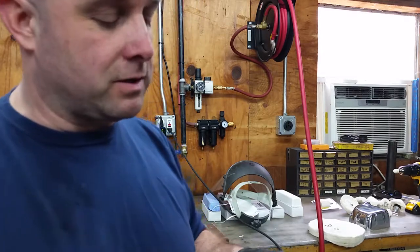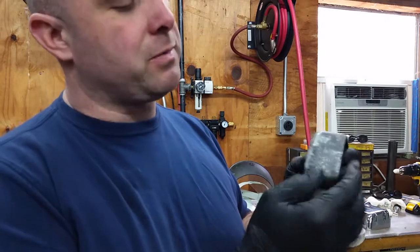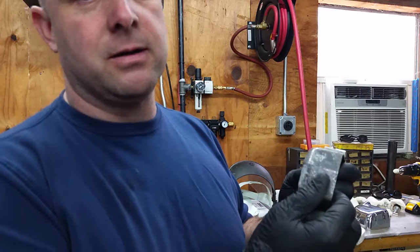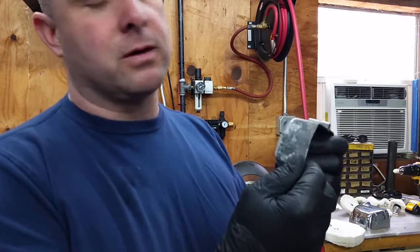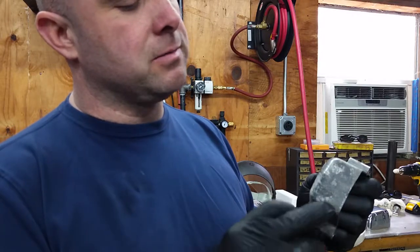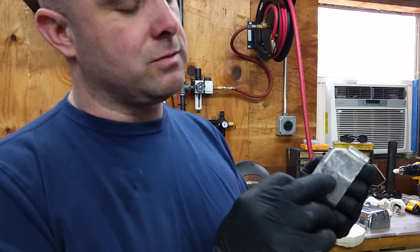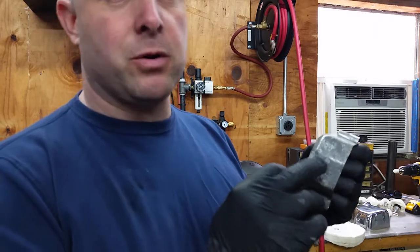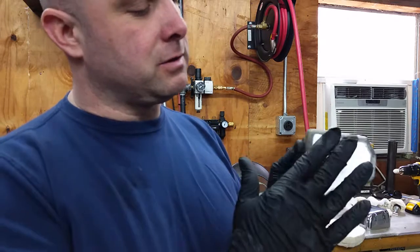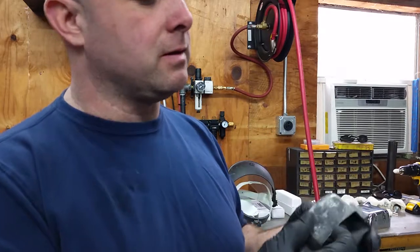And on this, I also talked about trying the sisal wheel with some emery compound just to show the effects of this really corroded area, how that may or may not work. We'll have to see how it turns out. What I've run into in the past is it'll get through some of the lighter stuff, but it just embeds those aluminum oxide particles deeper in the metal, and you just don't get as good of a final finish as if you went this route with sanding with the block and getting all that material out of there.